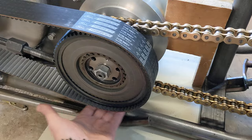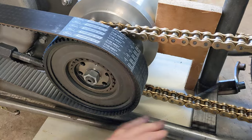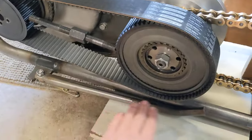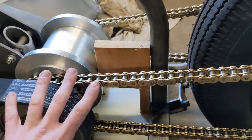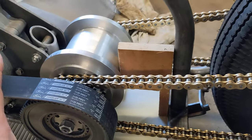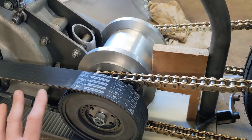The next job is to fit the tank. I've just raised the gearbox enough to get my fingers under there — originally I had some packing under there but it was a little bit close to the bottom of the frame rail. The top run of the belt wasn't quite parallel to the frame rail, and if I can get that parallel it will look all the bit nicer. It's all about clearances and practicalities — everything gets measured, then made, then remeasured against the actual components, and sometimes you have to make little adjustments.